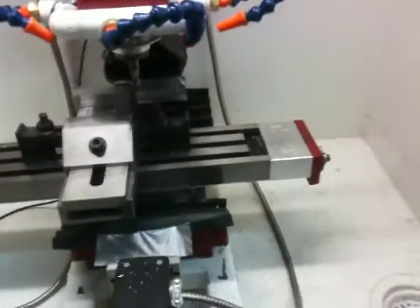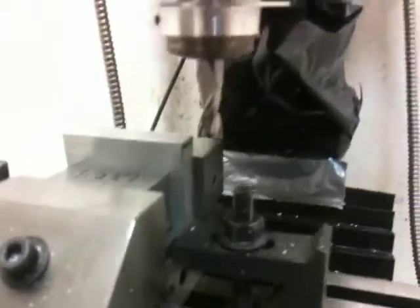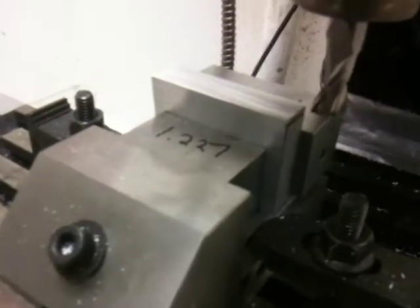So there's the drain — the whole thing is sloped that way. Just going to do some little tests here. Got a half-inch two-flute solid carbide end mill, brand new. We're going to take some off the top of that block to square it up with the bottom edge so I can clamp it in the vise nice.